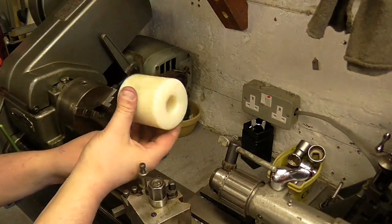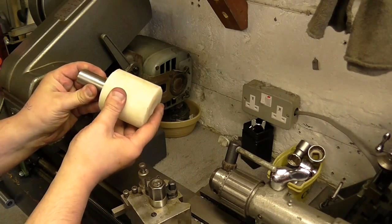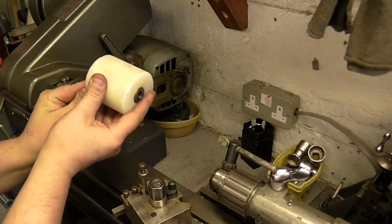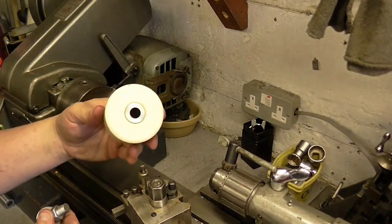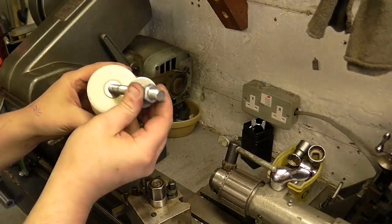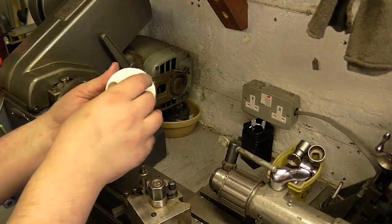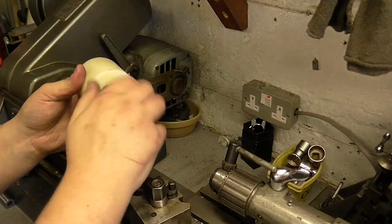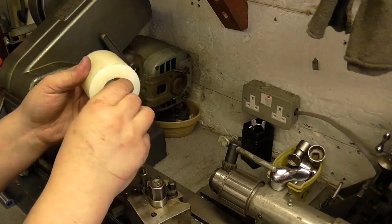Okay, so we got it finished — that's the finished mandrel part, it's just mild steel. And there you can see I've got a piece of nylon ready to turn. We slide the mandrel down inside there — it's a nice interference fit — and what we're going to do is pop in a piece of threaded bar with a washer and a nut on one end, pop a washer and nut back on the other end, and that will enable me to grip the nut in the jaws of the chuck so we can start turning down the diameter of the nylon.